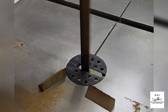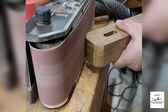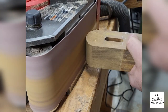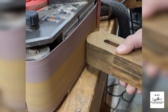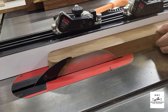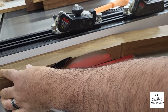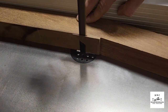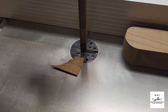For the top of the back stretchers, I wanted to make sure they were rounded off correctly. So I hogged off a majority of the waste at the band saw and then set up my belt sander strapped to the table to flush sand everything, since I don't have a flush sander. Then I went over to the table saw to get everything to final width, went back to the band saw to hog off more waste, and then cleaned up the rest with card scrapers.